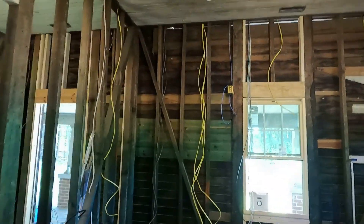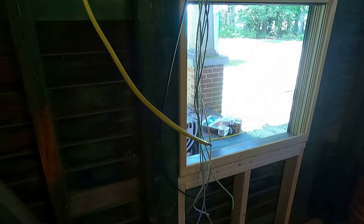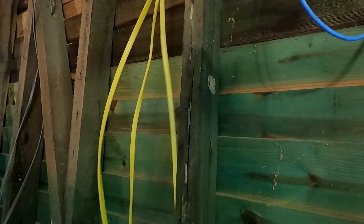So like here in the kitchen, we've got all these wires we ran that are just hanging. They all have a purpose and a place to go. Today we'll be putting boxes up. These will run into the box — I usually hang about seven inches out of the box, something to work with. Whatever's left gets stapled up along the wall, and then the excess gets pushed into the attic.